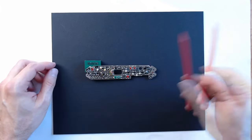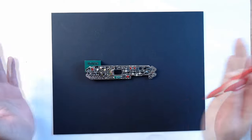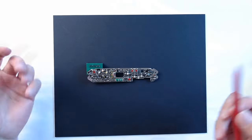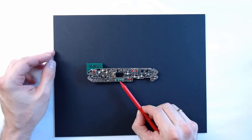There are two reasons that you should do this threshold adjustment at times in the middle of the timing range, like a 1/60 of a second. The first reason is that the discharge network is most precise in the middle of the timing range.